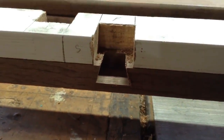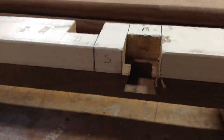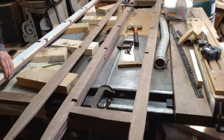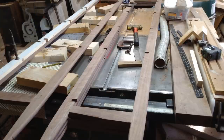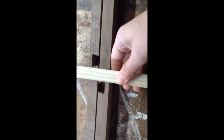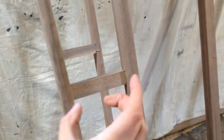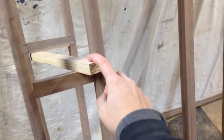Figuring out how to make jigs is sometimes the hardest part of any project, but they're really quite useful. These bushings — once you figure out offsets and how they work — are a great time saver. I can flip the jig to the front and have all my panels done. With them side by side you can see exactly how the shelf will sit in the piece. I made two test dovetails and hand-cut and rough-cut them on the table saw just to verify the alignments, then set them in place. That's the end of this video — you can see how they're going to sit in there nice and flat.